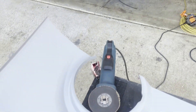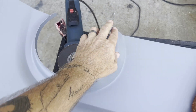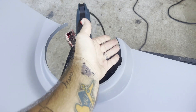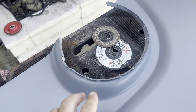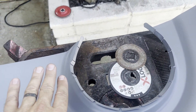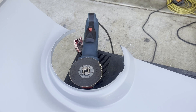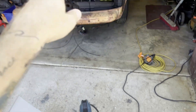A problem getting around the buckets with this new sheet metal is this lip here. Ultimately, I just don't need all of it, and I was not able to remove everything that was around that bucket that was there in the first place. So I'm going to slice off this outer lip. I'm doing it in stages — first I've cut a bunch of notches so it'll come off in smaller pieces. I'm going to work my way around with some cutting discs on my grinder, and then hopefully be able to put it in. I will be welding along this more front edge lip area around the bucket.